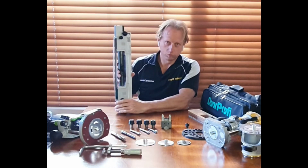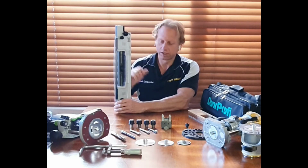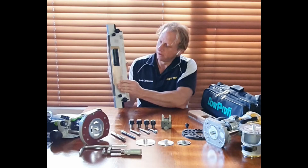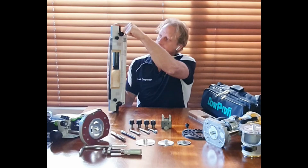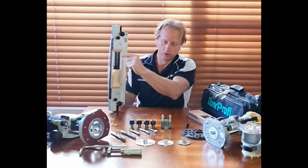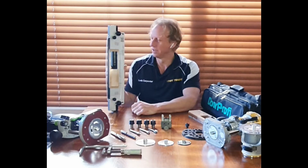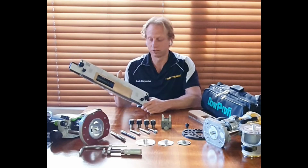It's designed also, when we're putting hinges on a jamb, we often come down 150mm from the top. In Russia they do about 200 or so. We had to redesign these templates and move them towards the top instead of being in the center. I've put them up higher like that, so that when you measure down, if you butt that up to the top of the head of the jamb, and you've got your 2.5mm gap there, from there to the cut there is 150mm. So that's how we work in Australia, and you can go more if you want, but you don't go less than that. I've seen people hang doors with hinges 100mm down from the top, and it's just not how I work. It doesn't look very nice.